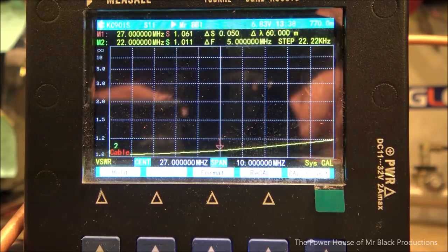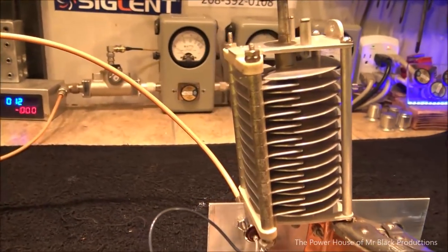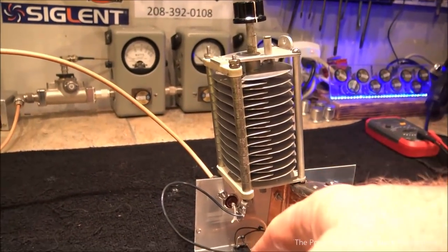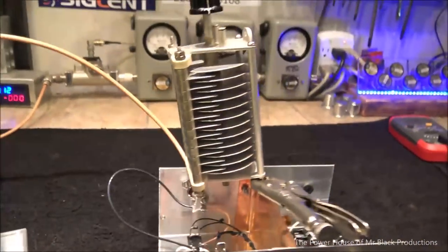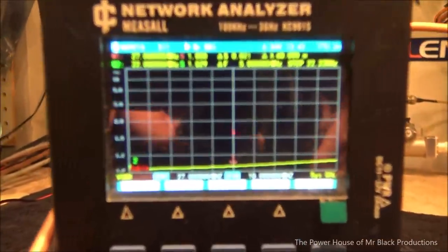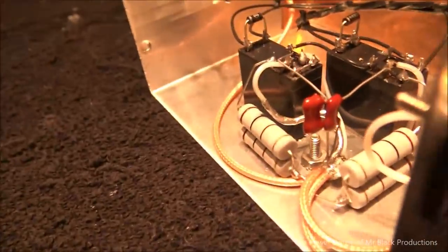Okay, well, we're going to be somewhere right in the 40s again. Look at how that's intermeshed. So I'm just going to grab the 40 puff capacitor that I just made up, that I was playing with on this particular setup earlier here. Slap it in there and see what we got. Because I bet you if I pulled this off and measured it, it'd be about 40-ish or so. Give me a second. Oh, this turned out better than I thought. Okay, so relaxed right now is a 1.05. Remember, that's going into the 50 ohm load.